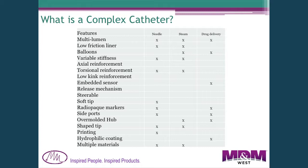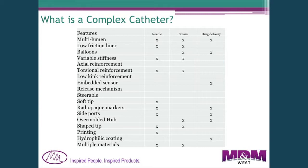I'll show an example of a release mechanism we've worked with on several cases. Catheters also sometimes need to be steerable, with multiple pull wires in the wall so you can tip the end one way or another. Other features include soft tips, radiopaque markers so you can see it under fluoro, side ports for delivering drugs, separation of multi-lumens on the proximal end for individual access, shaped tips, depth printing on the outside, hydrophilic coatings for low friction, and finally multiple materials — different plastics, nitinol wire, Teflon, and so on.